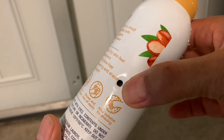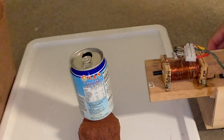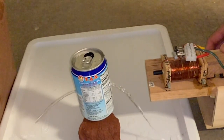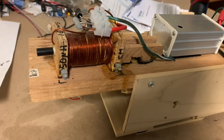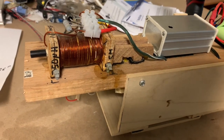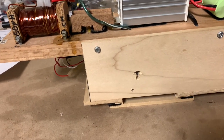This smooth hole here is the entry point — it's kind of dimpled in a little bit — and this sharp one where it's coming outwards is the exit. This is what happens when you fire it without a projectile. Notice the distortion of the very high current on the wires. The energy stored in this device when fully charged at 390 volts is about 1,000 joules, and 1,000 joules of energy is discharged in a microsecond or less through that copper coil. So using a regular switch would result in fusion or melting of the switch contacts, and you wouldn't be able to open the switch again.